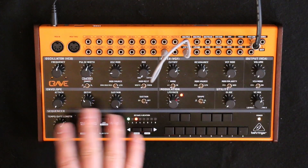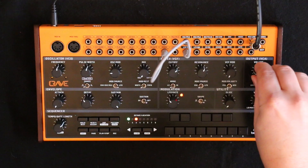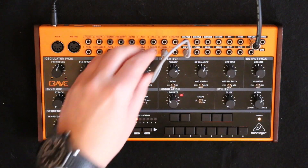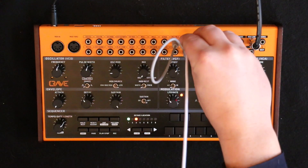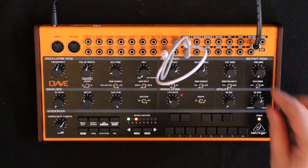What we're doing there is we're bypassing the VCA circuitry. But we also want to use the VCF for the second signal, so we'll take the LFO and put it into the multiple input. And we'll take the first multiple out and put that into the VCA CV in — so we're going to get the same effect.